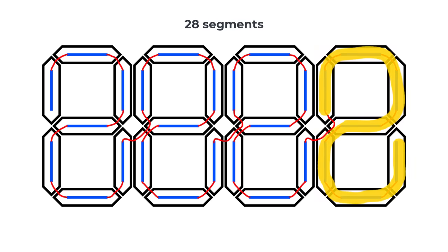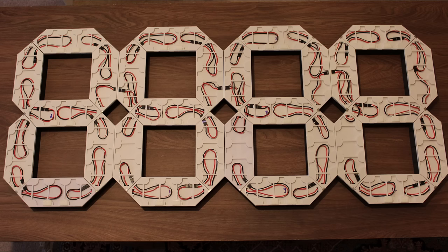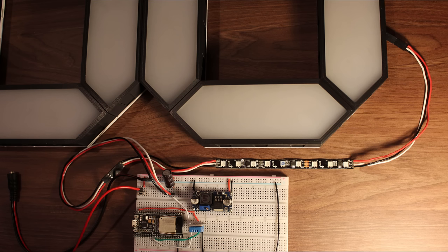As you can see, it is the same wiring pattern repeated across the digits. The start is a female connector and the end is a male connector. When you connect everything together, the female side is what needs to be connected to the breadboard. However, not directly — there needs to be an extra LED strip segment connected to it. We need this to be able to control the colors of the digits separately.